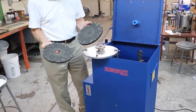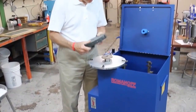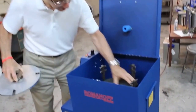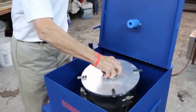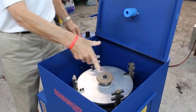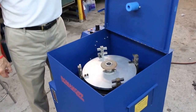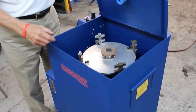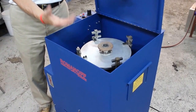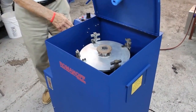Black rubber mold of various jewelry designs, made in a vulcanizer, goes into the casting machine. It's in place. An aluminum cover — the pressure plate — goes on top and is locked in place underneath the arms of the machine. Closing the door activates a switch which puts air pressure on a piston on the bottom, squeezing the rubber mold at the pressure you have set.